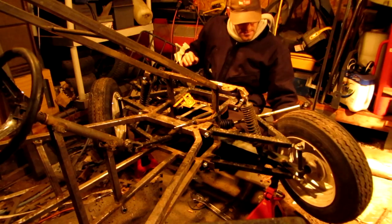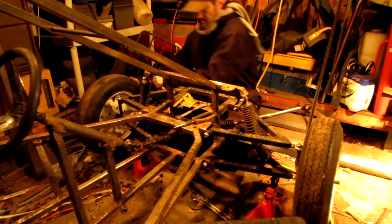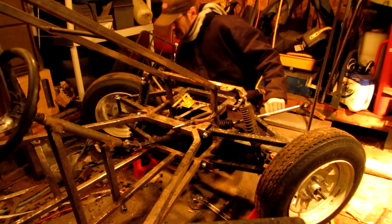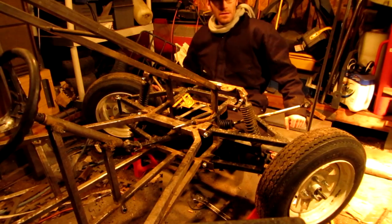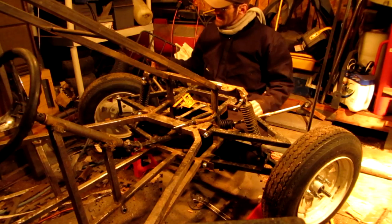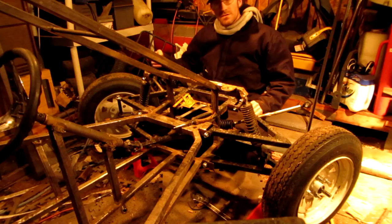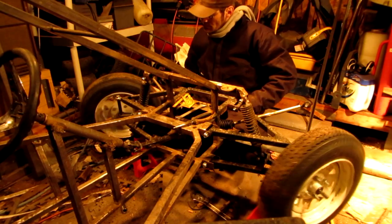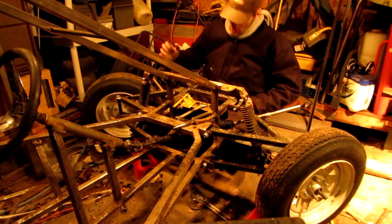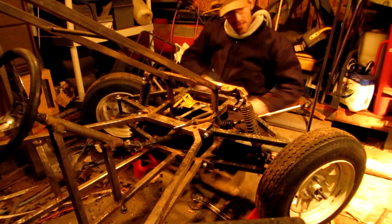I'm getting this thing on both tires. On both tires, the ground is hitting this outside tire and bending it in. It's not even pushing in on the tie rod — the tie rod is allowing it to go that extra distance in the rotation. So when the ground hits this, it automatically bends it in, bends this tire in sharper than that one.